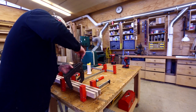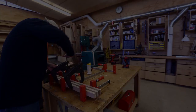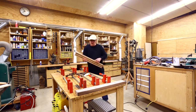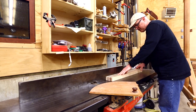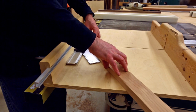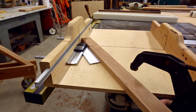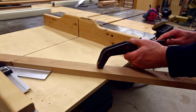At this point what I'm worried about is getting the joint between the pieces nice and tight — the top, bottom, and sides I don't care so much about; it should be close but not perfect. Then I'll joint that face on the glued-up piece to get it nice and flush, and plane the other side to make the two faces parallel. Then I'll cut these strips at an angle, which gives me a bunch of segments where the pattern is now at an angle.